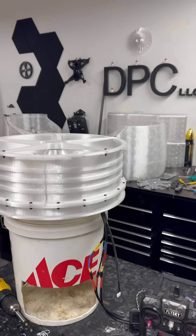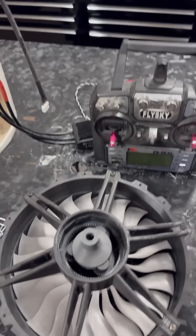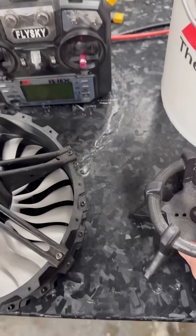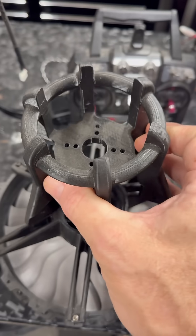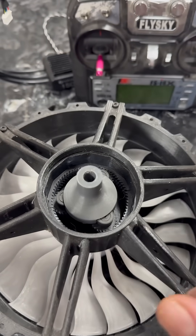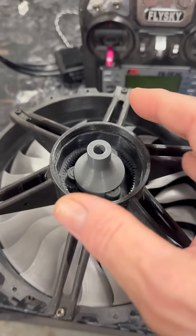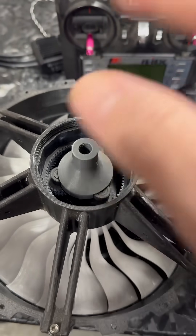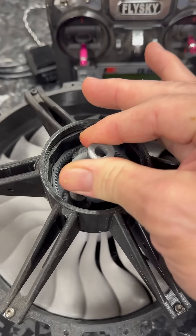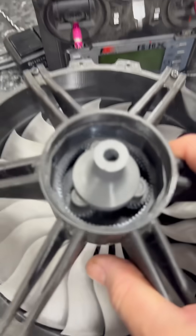Everyone's been seeing this monstrosity — still printing casework, but this is kind of where I started. This engine mount actually sits above here and there's a 10-millimeter collet I have to reprint; this is just an 8-millimeter one for an experimental motor. The issue is, no matter what — nylon six, whatever you use — you strip this out. This is a four-to-one gear ratio and I can barely turn it without having an issue.